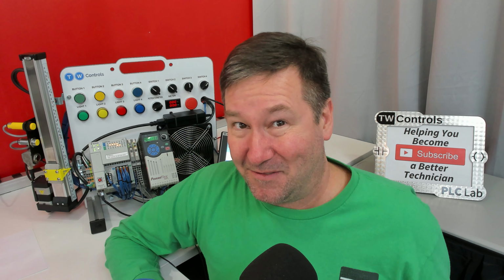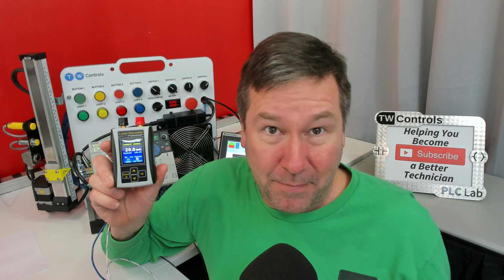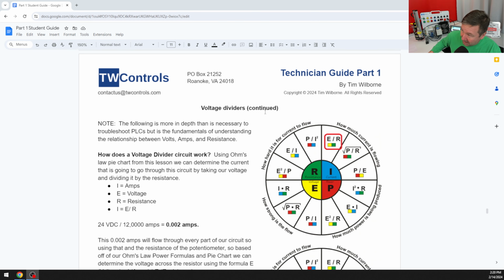Now, my main question is, why are you still so insistent on shortcutting? Why not just get an item that'll help you troubleshoot your 4 to 20 milliamp circuits? It's time to break out the Ohm's Law pie chart, because what you're not considering in your equation is, yes, we have 24 volt and you're wanting to short it to your analog input, which would be current. And yeah, you're talking about your load resistors, but you're not thinking about this power piece right here.